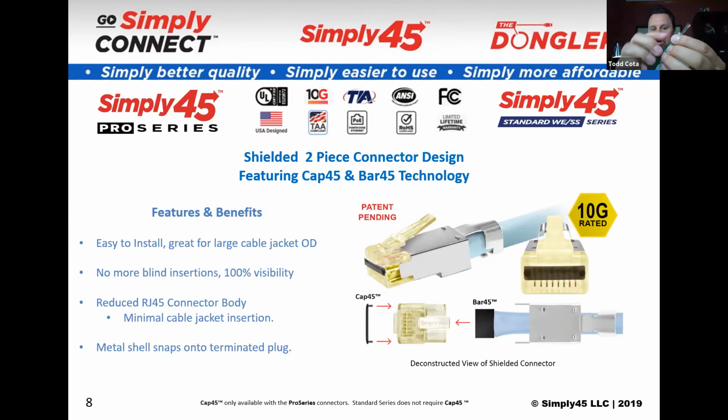So that large jacket sits on the back half of the connector, right? It doesn't have to be inserted. And then once everything is crimped, you actually take the metal shell, slide it up, and it snaps into place. And now you've got a shielded connector. Then you take your drain wire, put it to the side, and crimp it with the external tabs, and voila, you've got another shielded connector.